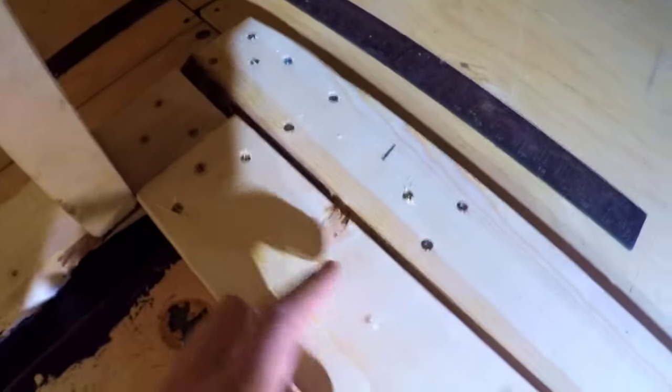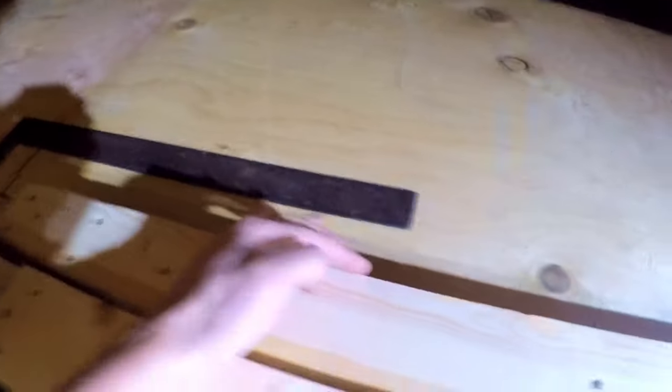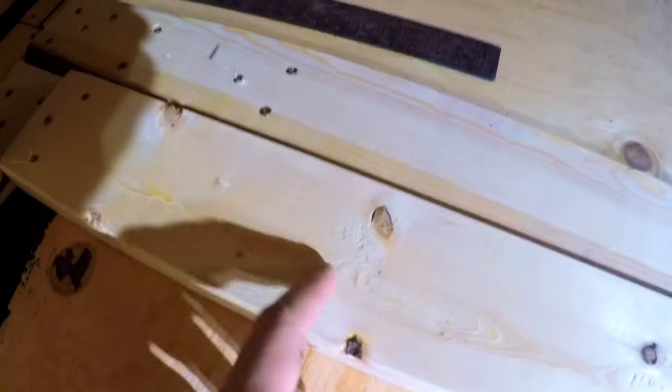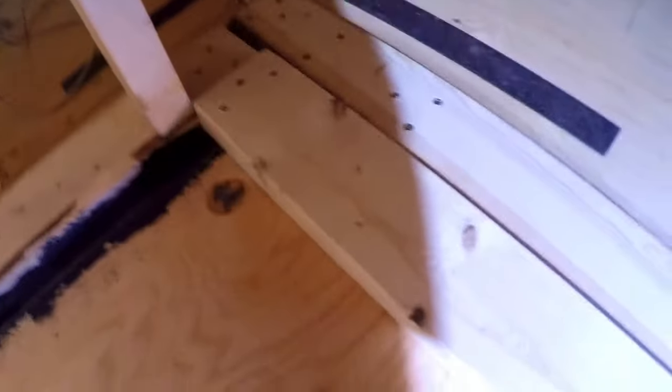Right, so about to put the last one in this wall in. What I ended up doing is I had to do some measurements, and originally I was going to go off this wall, but I'm deciding to go off this wall because on that edge out there, say this was the outside edge, that's going to be technically the 18-foot wall. So what I did is I've gone in an extra 2x4, also because I've got this joist here. I needed just a touch more clearance to make the 2 foot and then the board that's going to go up this way be able to fit. So that's why this piece is here.